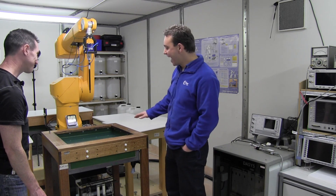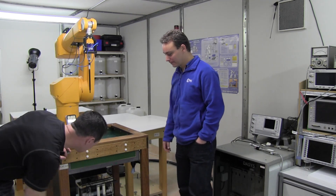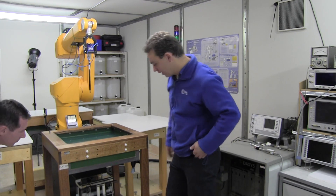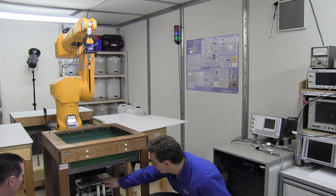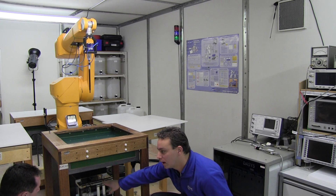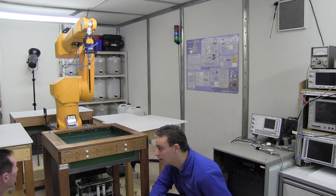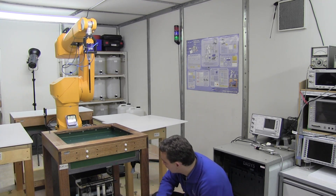It's pretty close. We do a 2D scan, find the peak, and then do a 3D scan around that to find the penetration depth and the average value. This isn't motorised — it just manually rotates, right? Yeah. The phone sits on there. This is all made of plastic and fibreglass — there's no metal parts in here, and same with this frame, because any metal parts can distort the field. This design lets us get the angles exactly right.